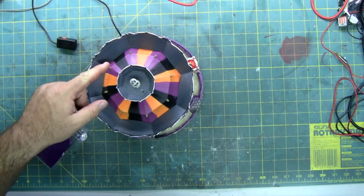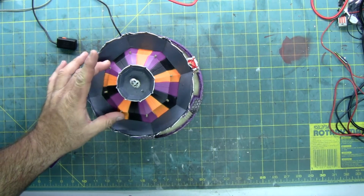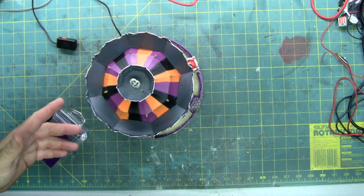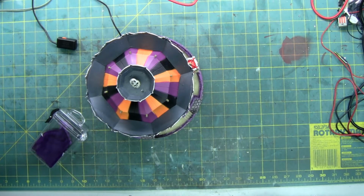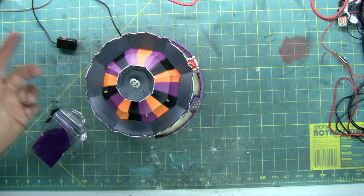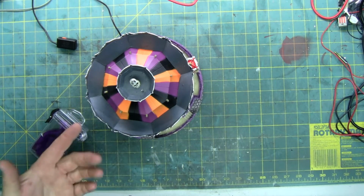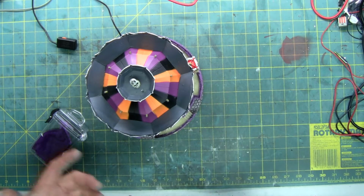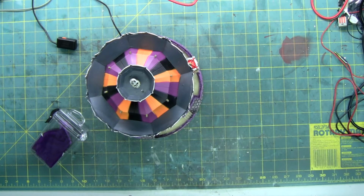Sometimes when a light gets shorted out, it's pulling more power because there's less resistance across all the lights if they're in series. And then the resistor overheats. I've seen that before. It's not very common though on an LED. Usually what happens is when one burns out, they all just quit working. I have seen it where the wires have just touched each other. They use cellophane tape or hot glue or resin as an insulator. It degrades and then the wires touch something else. Usually it touches the hot power to the negative power and the resistor overheats and burns.